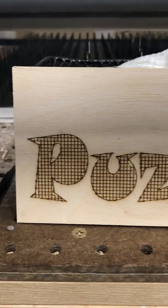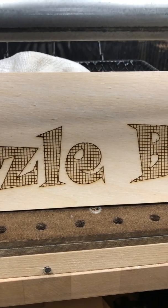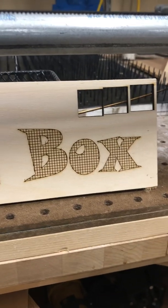I had to use a text editor to do that — I don't know of anywhere I can use a post-processor to fix it, but normally that's where you would do it. You'd have your program's post-processor know that any time it needs to turn on the laser, it needs to insert two commands instead of one.